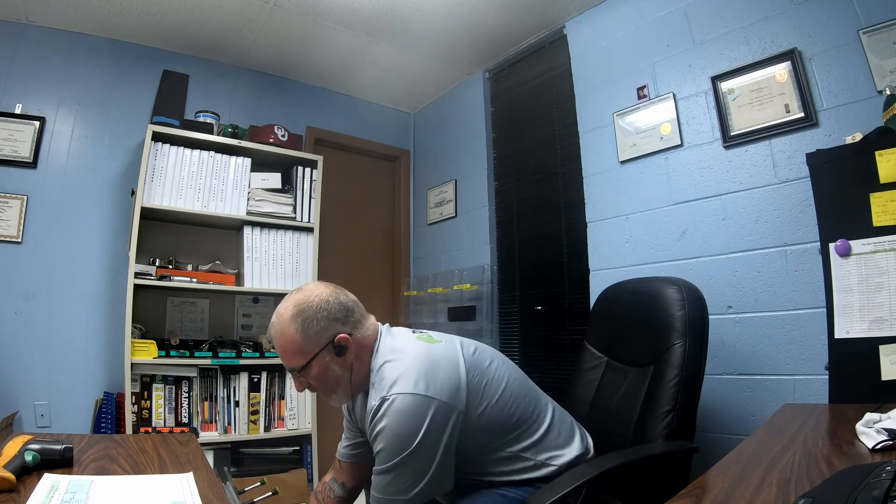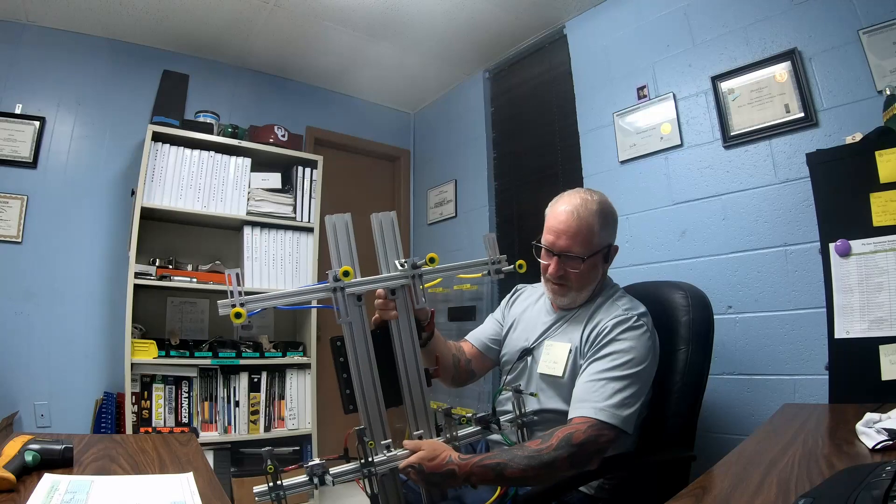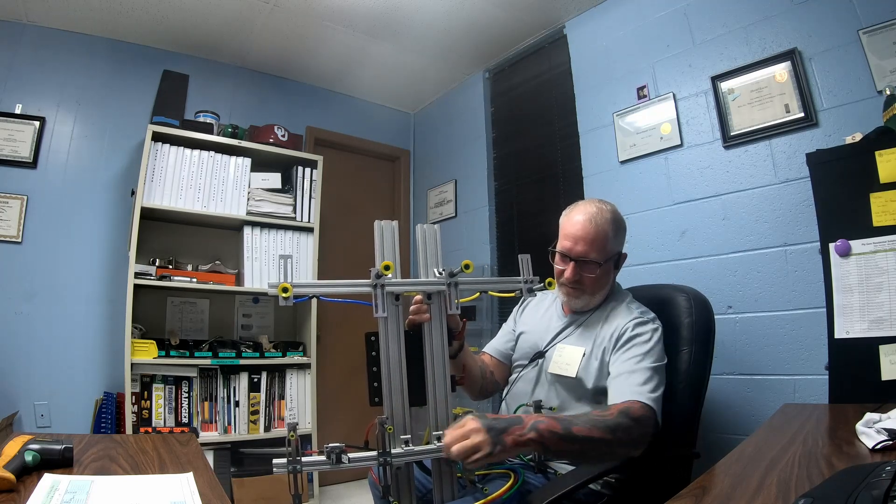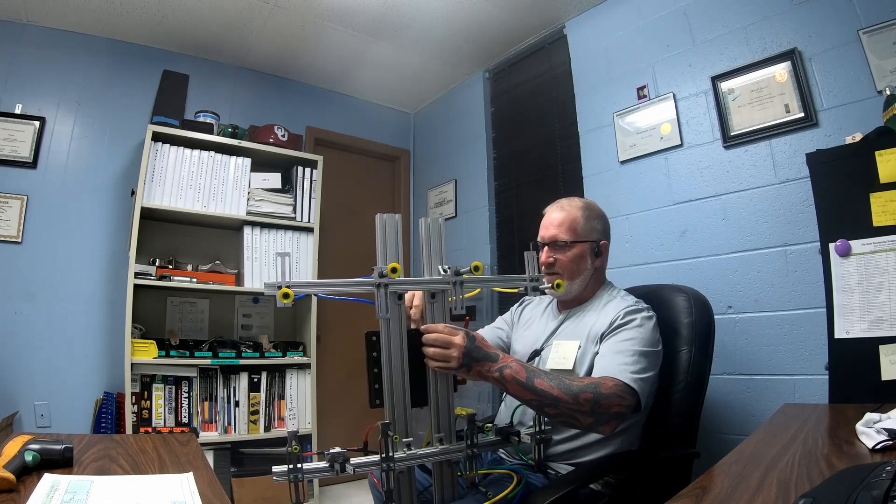Here's a robot that I put together that has the dovetail and everything on it. You can see this part here will grab a part here, a part here, a part here, a part here. Then you've got a runner in the very center. The original dovetail mounts to here — that's the old style. This is the new style. These mount to the back of your dovetail. This piece is no longer in existence. You mount this to the robot and then you can do quick changes, making sure all your vacuum lines are in the same spot every single time. You've got suction 1, suction 2, suction 3, suction 4, gripper 1, gripper 2. They make the aluminum profiles to keep everything a little lighter.